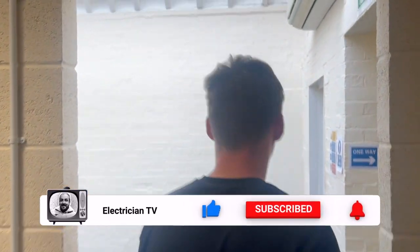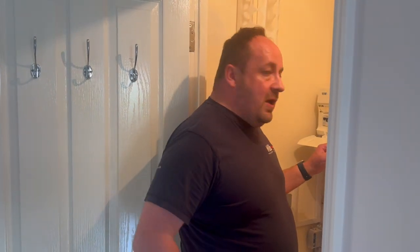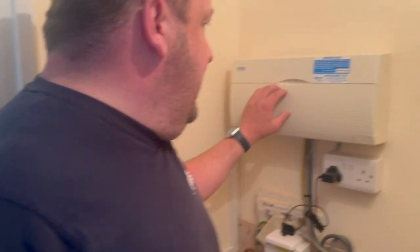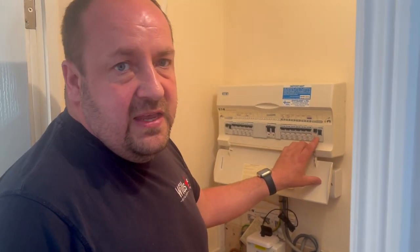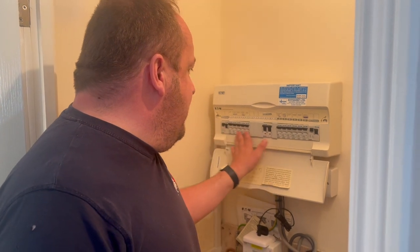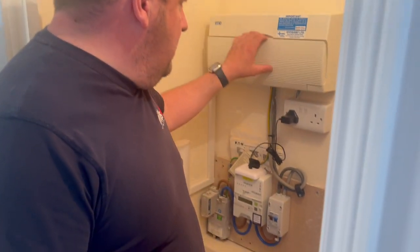It's Monday morning. We've got Jackie Boy and Ebbs here with us. We've got a four-bedroom, three-storey house, which is why Jackie Boy's with us for a couple of days — he's on summer break from college. So come in here and I'll show you the fuse board. We've literally just arrived. It's an Eaton dual RCD board. The RCDs aren't going to be much of a problem. These are AC-type, so that's obviously an issue — I'll probably recode that as C3. It's also got an isolator, so all in all should be alright.